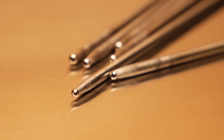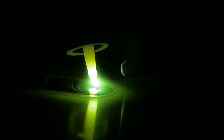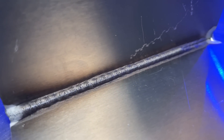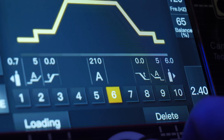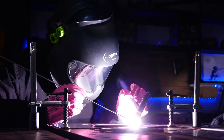Balance is designed to do something really important. The positive side of the cycle clears oxide away from the welding area, keeping it much cleaner and easier to weld. The negative side gives you more of a penetrating effect into the base material — this is the side that essentially affects the base material. There are always going to be different scenarios that call for different balance settings. I have a lot of these settings pre-saved into memory banks on my machine for specific joints, so I always keep a consistent tungsten shape.